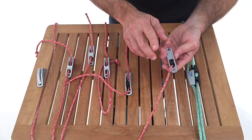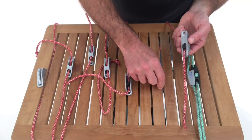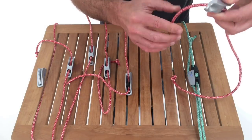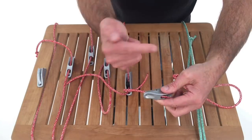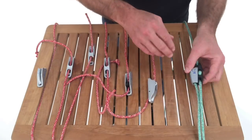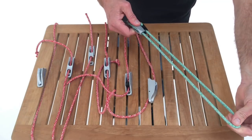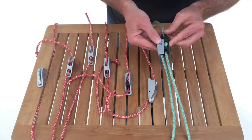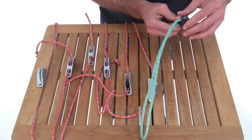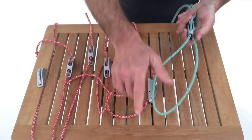This one is unique — it has the roller on the underside. If you had a load under the mounting surface, you would cut a small cutout right here and your line would lead through the mounting surface, and the roller would redirect it into the jaws of the cleat. And lastly, this is an inline clam cleat. If I had an awning or anything I needed to adjust but don't want to mount this, I can put the cleat on the line itself and change where it's located — giving me a two-to-one purchase right there.